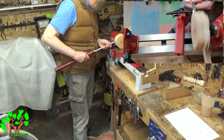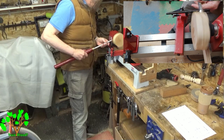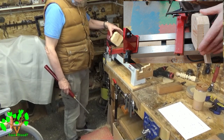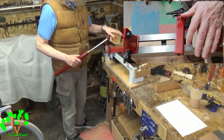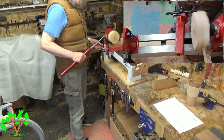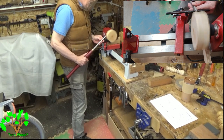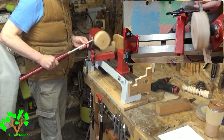As you can see, it's starting to slow the lathe down because we're taking slightly bigger cuts now. I'll stop the lathe, and you can see now that we're taking quite bigger cuts now, so there's more forces involved, and this little motor will find it hard. The longer the cut, the more forces are involved, and the motor will slow down. So now we've got it running reasonably concentric, we can speed the motor up, gives it a bit more torque. Again, we just touch the bevel first, raise the handle until we get a touch.